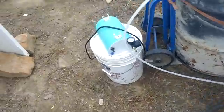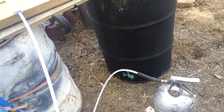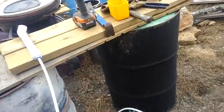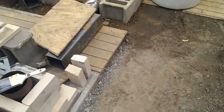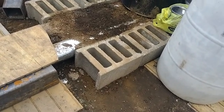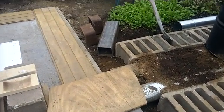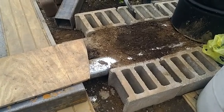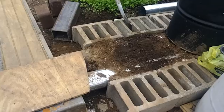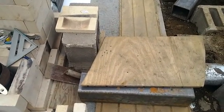That's aircrete. You can make blocks out of it — all kinds of things: retainer wall blocks, phony stone. There's a company out of Lithuania that sells about 15 different patterns of phony stone. You can make a wall and insulate it at the same time if you make them out of aircrete. Retainer blocks — instead of being an ugly block, you could use these. People use Quikrete to make their own retainer blocks, but if you made them out of aircrete, they'd be a lot lighter to handle. Two or three stacked high for a raised bed or a retainer wall around a fire pit.